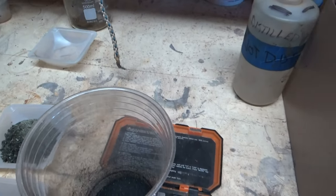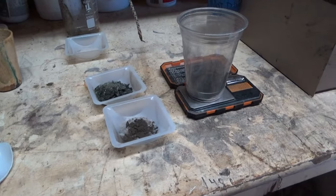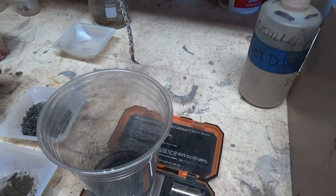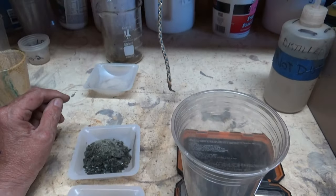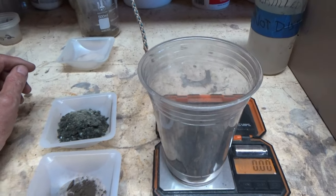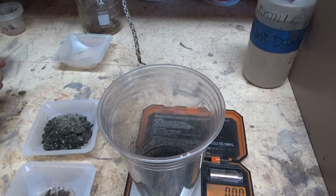Your silica and borax should be in a 4 to 3 ratio — so in this case I use 8 grams of silica and 6 grams of borax. Your soda ash should be about five times the size of your charge, so there's 10 grams of soda ash in there. We've got 20 grams of litharge, which should absolutely be enough to grab everything in the area, and 2 grams of charcoal, which should be enough to reduce anything in there.